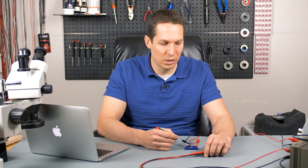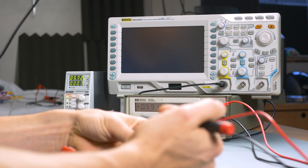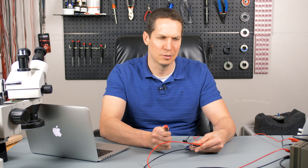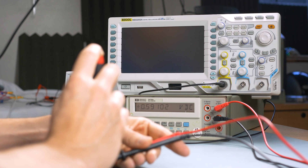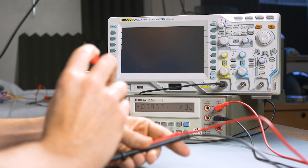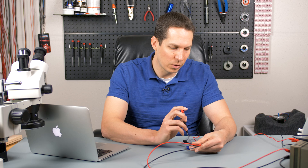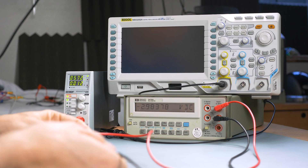Right now I have it set up with a 1000 ohm load — I'm a bit worried about burning out this 100 ohm resistor. There's about 0.6 volts across the 100 ohm resistor, which works out to about six milliamps. As I drop the load resistance — increasing the current draw — you can see a bigger and bigger voltage drop across the series resistor. That means we're wasting more power in the resistor, and we're also not getting enough voltage drop across the Zener anymore.